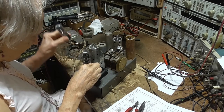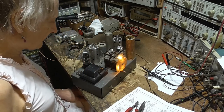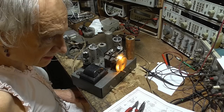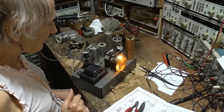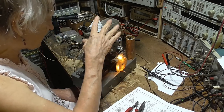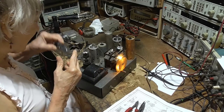Okay, first I'm going to pull out this rectifier tube. Okay, let's try again. We have no B+ now. Okay. Pulling 18 watts without the rectifier. Okay. See, now that's just these tubes here. And that's okay. So the transformer is good. Okay. If I plug the rectifier in,